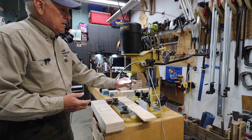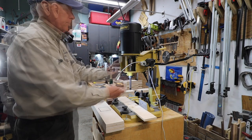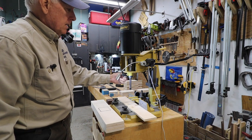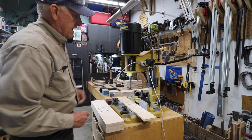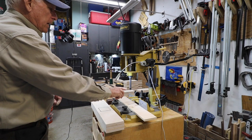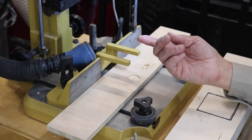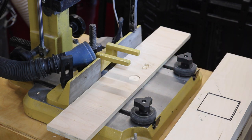When you go to install the chisel there's a technique for that. This door opens here and you swing over if you have a half inch chisel one of the two swing arms, then when you push both units up they come up against that swing arm. Then you lock down the internal bit, swing the arm out of the way, and push the square chisel further up. That will end up positioning the bit a little bit below the cutting edges of the square chisel.